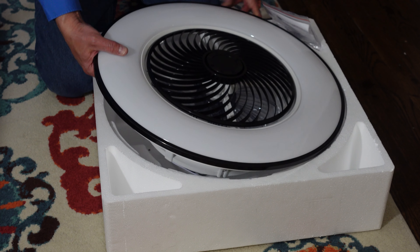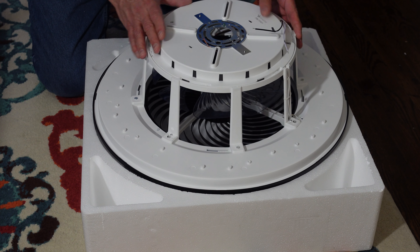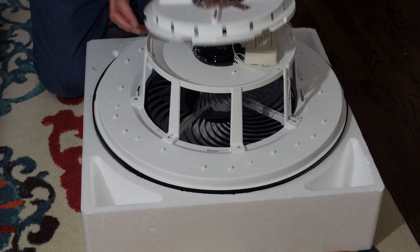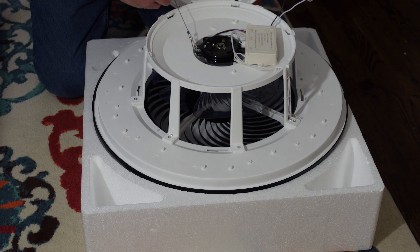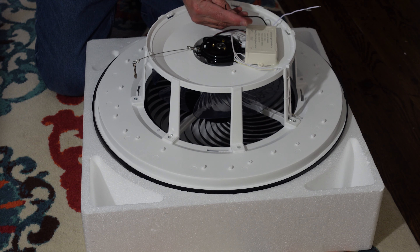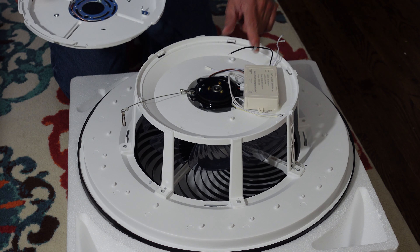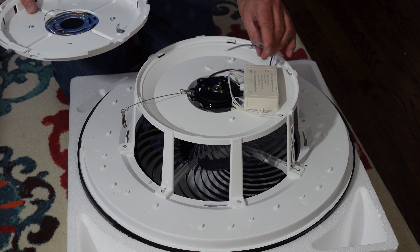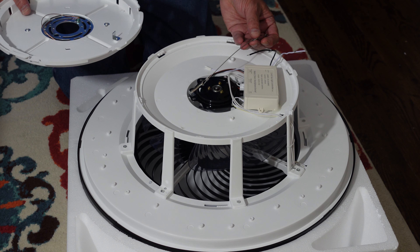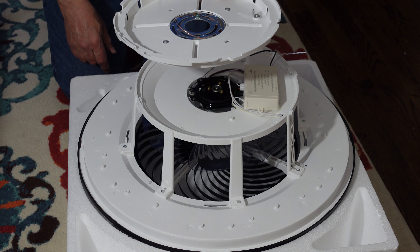I did peek at the instructions already. This thing should just sort of twist off at the bottom — if I turn it counterclockwise, it should just come. There we go. You hit the notches and this whole panel comes off. It has a retention cable on it; I'll go ahead and remove that for now. We are going to need that retention cable later when we're trying to wire up the fan, which has a black and a white wire going to a little controller unit. We'll have to wire that up while basically looking upside down at it, but the retention cable will keep it secure. Now we have to check and make sure we can get this thing mounted into the mounting brackets up in the ceiling.